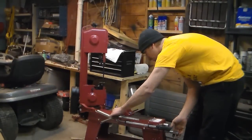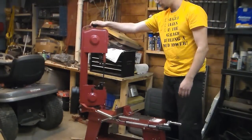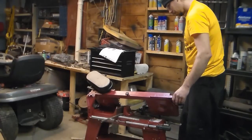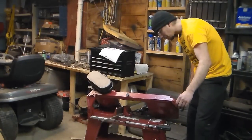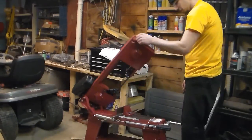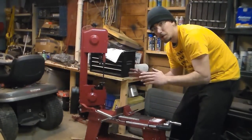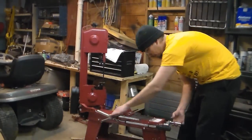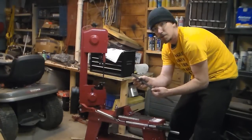First, we're gonna try the 1/2 inch, just cut a chunk off the end of it. Now, before anybody yells at me, yes, I know I should be using cutting oil. I'm going to be buying a high-end cutting blade for this, so I'm just throwing it through right now. But that cut off, slick as can be. Very close to square, actually.